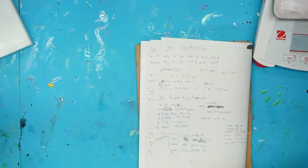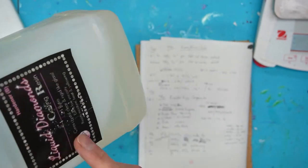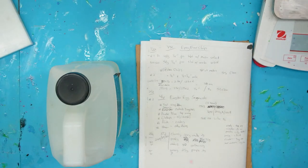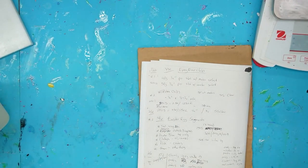Alright, let's get rolling. We're using Liquid Diamonds — there's a link in the show notes to Turner's Warehouse. It's an epoxy with a 2-to-1 mix ratio. I recommend doing it by weight; this is a unique resin where you can technically do it by weight or volume, but weight gives you a more accurate measurement. It has about a 40-minute working time at around 70–72°F room temperature, and it's a thin-viscosity resin.